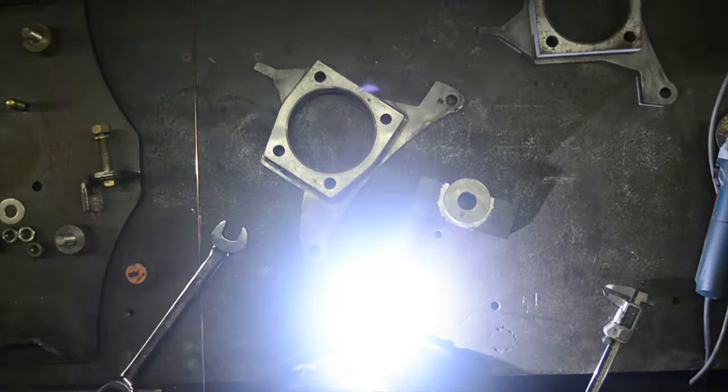The top bend in this spindle backing plate is another little tricky one. The bend is very close to where this ball joint flange is. When this tips over, the upper ball joint slug fits into there. What I was finding was, since my bend lines are so close to this, whenever I bent this, these would pinch in, and then it was a hell of a time trying to get this to fit. So the simple solution was, I just machine up an aluminum slug that fits in place of that, holds that tolerance, and then when I bend it, that slug stays in there and keeps everything straight. Here you can see it holds my circle. It deforms a bit on the underside when it pulls, but my circle remains where it needs to be.